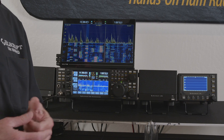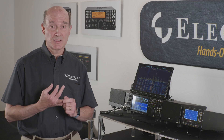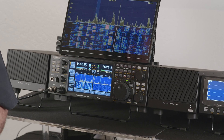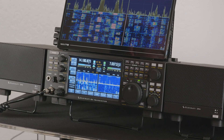In the K4 design, we focused on continuing our super high-performance CW capability, with additional improvements in receive filters, transmit T/R time, and so on. On receive, we've achieved very low distortion, which in the middle of a contest or chasing DX significantly reduces listener fatigue. On transmit, we can do very clean audio on regular sideband and on ESSB expanded sideband — up to close to 5 kHz. In our next software release, we're adding up to 5 kHz audio bandwidth in AM as well. The radio also includes a built-in reference that can be locked to an external 10 MHz reference for GPS-based accuracy down to a fraction of a Hz.